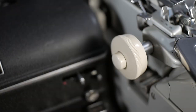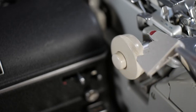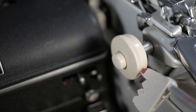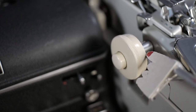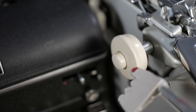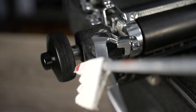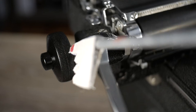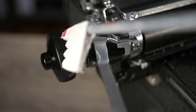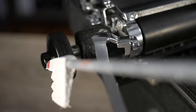And again, comparing user controls, the carriage knobs are very similar. Of course, there's a difference in color. The FP has the knurling on the edge of the rim of the knob only in the outer part of it, where the inner part is smooth, and it also tapers in a slight conical shape. Whereas with the KMM, the knurling goes across the full width of the rim of the knob, and it's not conical, it's more slightly rounded on the rim. The button for the clutch is pretty much the same, however.